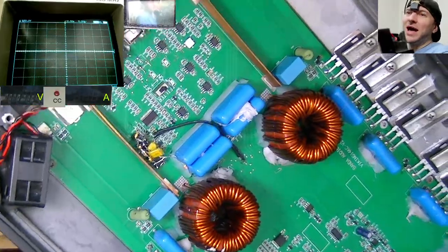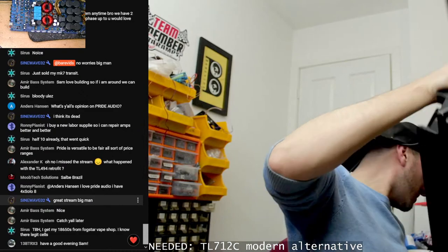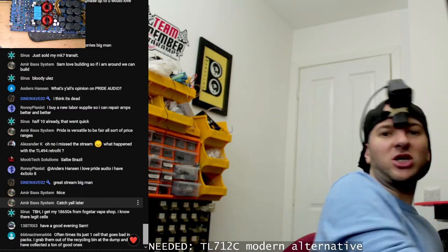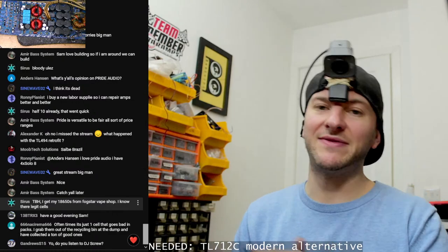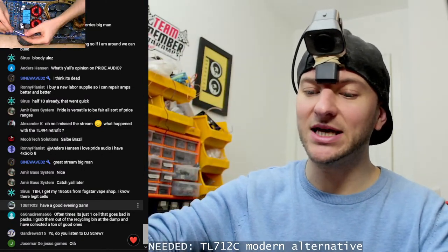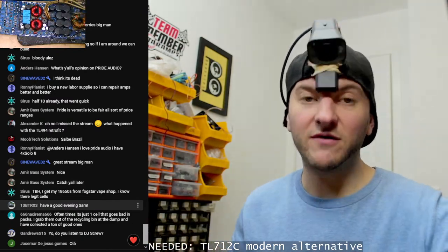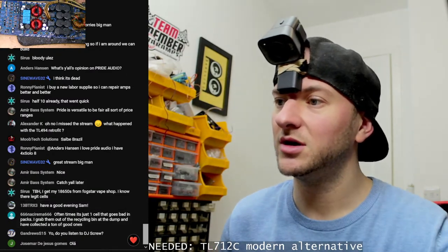Yes, we have retrofit. We have it working with pin 4, dead time duty cycle control is working. We used the PWM0 line from the MCU, and we sent that into a transistor with an RC network, as Michael suggested, and after tweaking around with some resistor values, I got that working beautifully. So yes, that is almost ready to go. I just need to fit some new power supply drive ICs, and then it should be ready to go for testing, which is good fun.